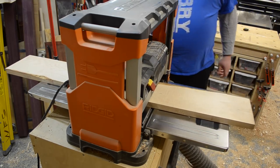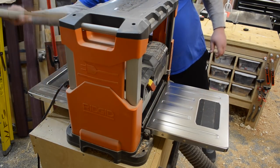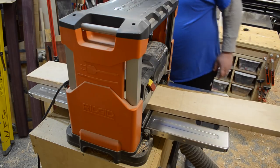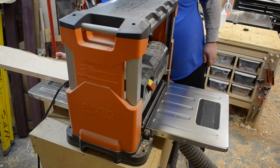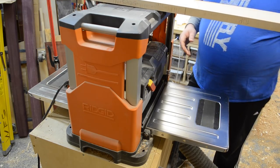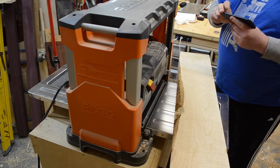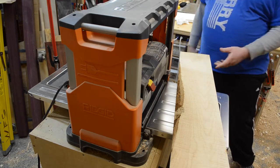This board actually had a slight cup to it, and I put it crown side up in my planer. I just wanted to do some really light passes so that the in-feed and out-feed rollers aren't compressing that cup down to the planer bed, and then I could take light passes and hopefully eliminate that crown. When doing this, I realized my layout line where that crown was came off first — a visual indicator that it was working. I was removing that cup and not flattening the board too much.